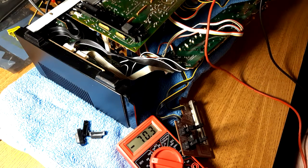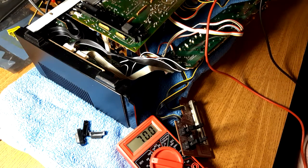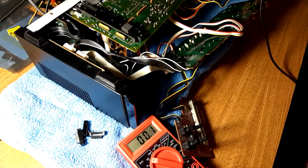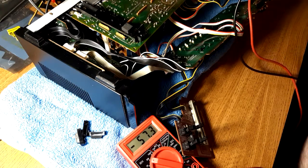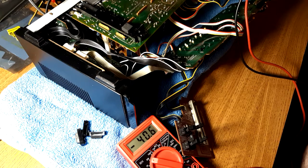That makes me think we have a resistor somewhere that's gone high. This thing scares me whenever I work on it — look at this: 70 volts on our collectors. Okay, I shut it off — hear it click. Look at this, it's still sitting high. It'll eventually fall to about half a volt.